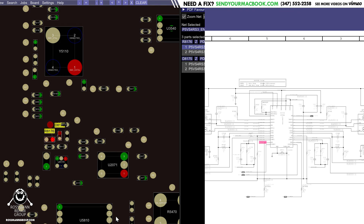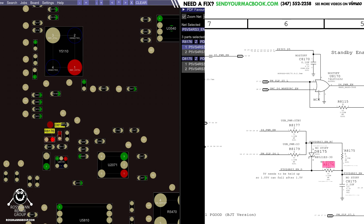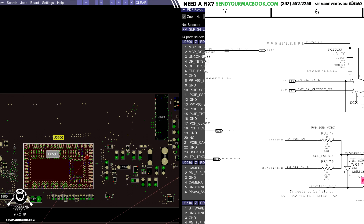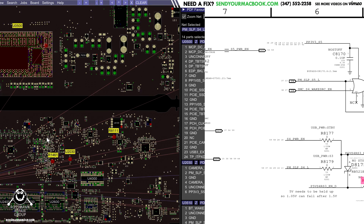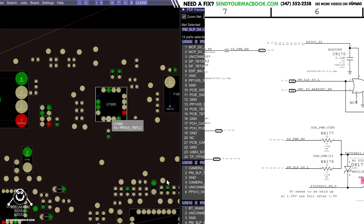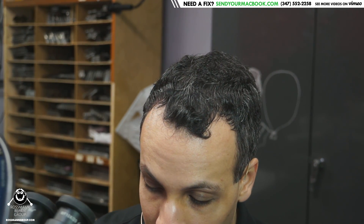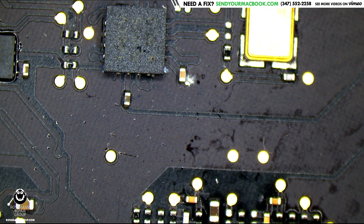So we're going to go back and trace through. That signal to create the power rail that was missing comes from PMSleepS4L. PMSleepS4L comes directly from the CPU. And what also goes to the CPU? The real-time clock signal — that also goes to the CPU. So if your real-time clock signal is distorted or jagged in some way, it's going to stop the board from working.